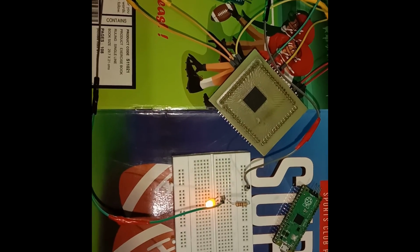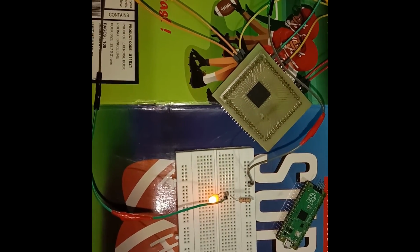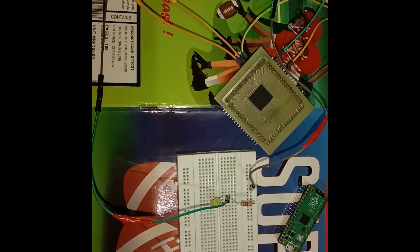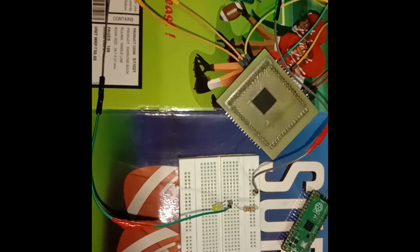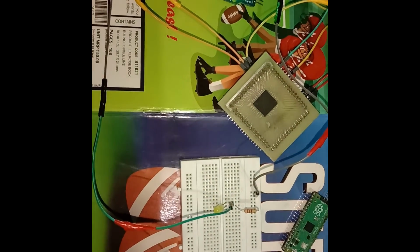Just upload it as it is to your Atmega64 microcontroller, and here the built-in LED is pin PB5, or physical pin 15 of Atmega64 or Atmega128, and hence our connected LED is now blinking after successful upload. And now your microcontroller is ready for your every modified sketch.